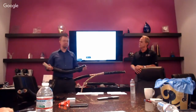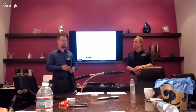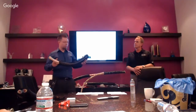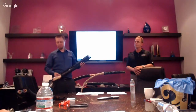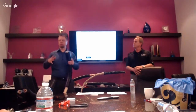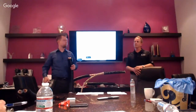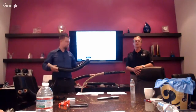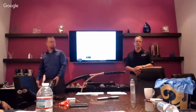It's just that getting one sweep down and one sweep up is almost never the case. So if you have a turn in the middle or an offset or something, you may plan for a 12-inch and a 6-inch, and it probably won't work. So bottom line is, the larger the conduit gets, there's more room for things to move and get wedged. So there's a little bit of art, a little bit of science. If it was more science, we could be more absolute.